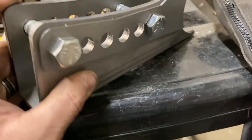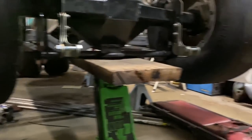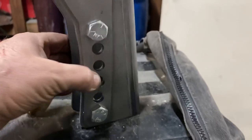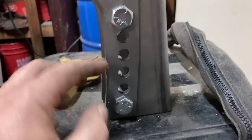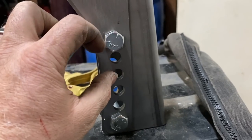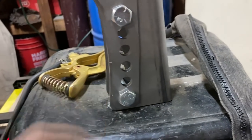When you're messing with cars, this goes on the bottom of the rear end. We talk about instant center, and my car over here has the four-link stuff, so it's got a bunch of holes in the bottom bracket just like this. These are half-inch bolts — mine are five-eighths on a true four-link, and sometimes they're three-quarters. The smaller the bolt, the finer the adjustment. If the holes are one inch apart it's going to be more change, so that's one of the good things about these.